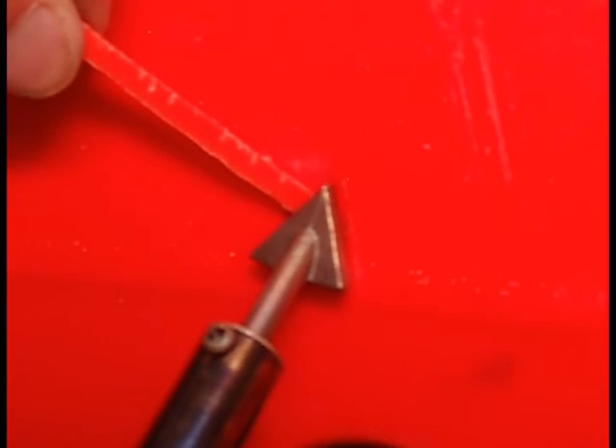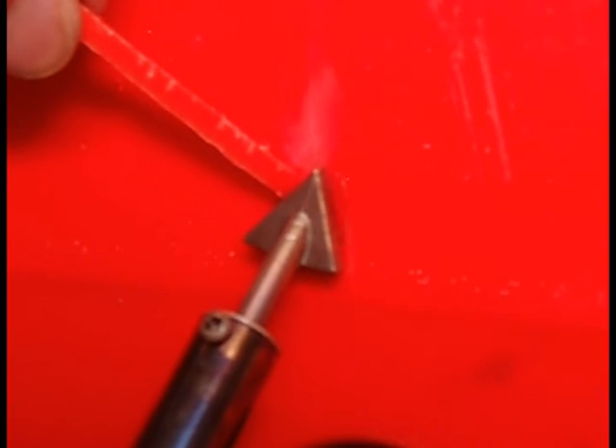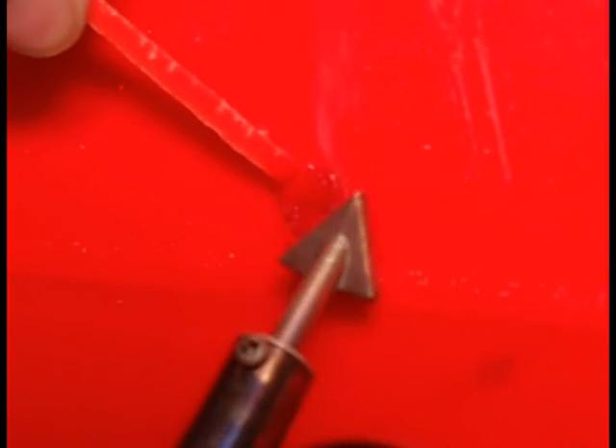Although not shown, aluminum tape can also be used as a mask on the front to prevent excess plastic from spreading too far beyond the hole. The front tape would have a slightly larger hole to expose the plastic hole. You would peel off the front tape before the plastic cools and then smooth the area around the hole.